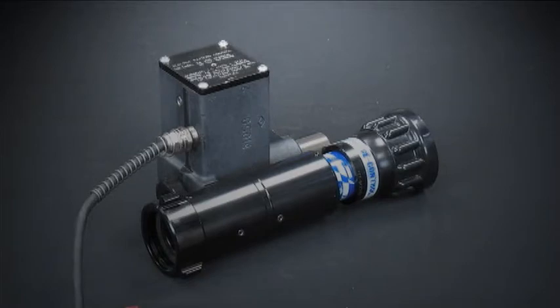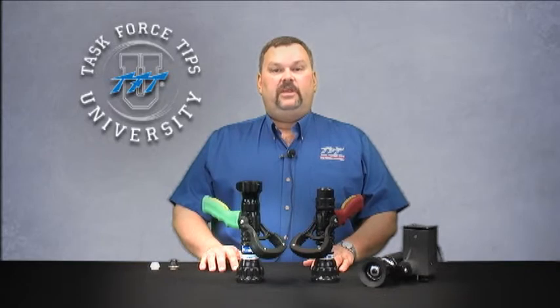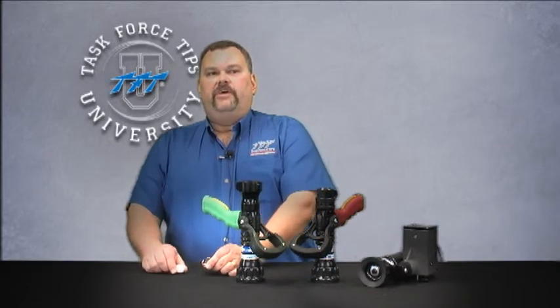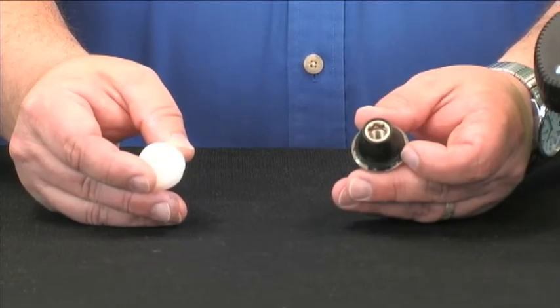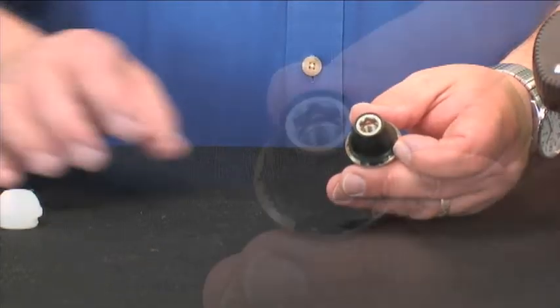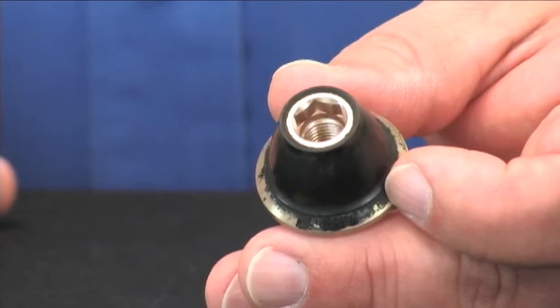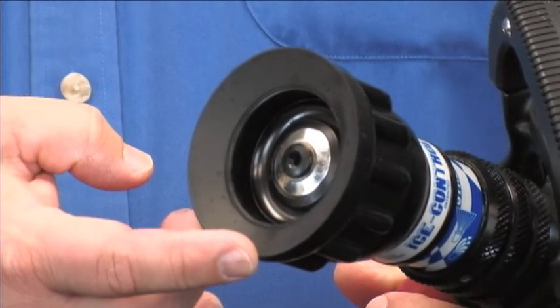Although they are similar to the automatic firefighting nozzle series, there are several differences — some that you can see and some that you can't. One is the difference in the valve seat, or as we call it the nose cone. A typical water automatic nozzle has this style, and the de-icing and anti-icing nozzles have this special material to hold up to the heated glycol fluids. Also, there is no inlet screen on the de-icing nozzles to reduce the chance of shearing the anti-icing fluid. Also, the front bumper is toothless — once again, this helps to reduce the amount of shear to the fluid.